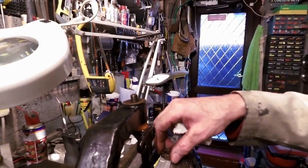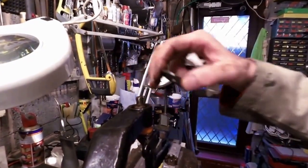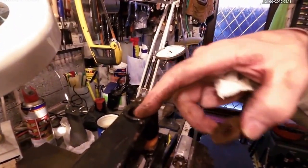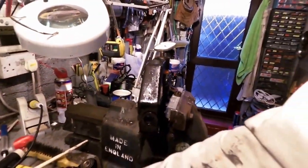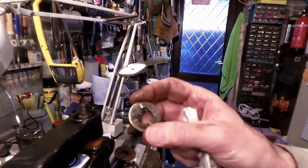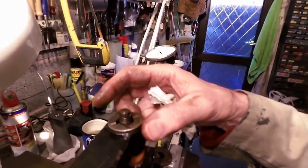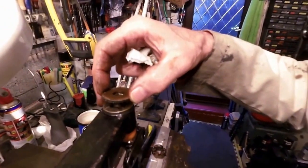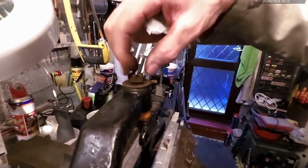The problem is you get so far and the inner diameter of that washer is too small to fit over the spindle. What I've realised is that the thrust washers from the lower wishbones happen to be just about the right size and actually fit over the spindle. With that on there and the other washer on top, you can get it another couple of millimetres at least.